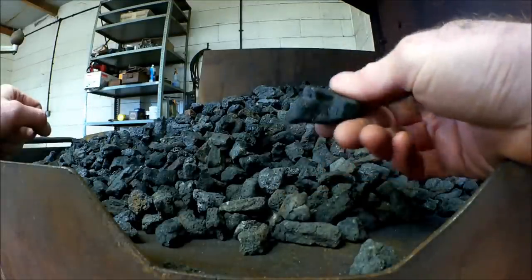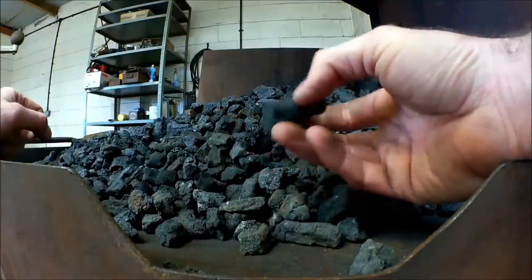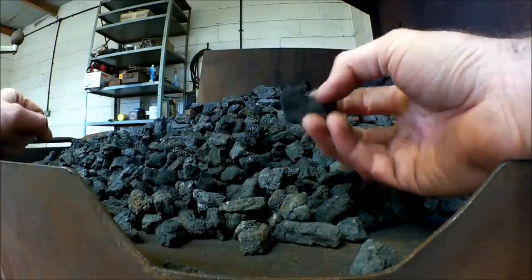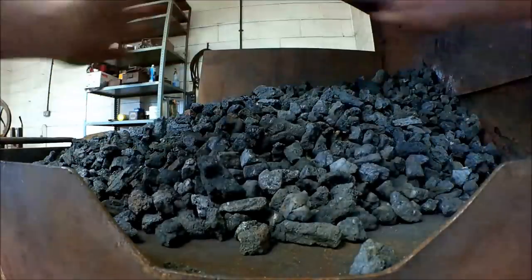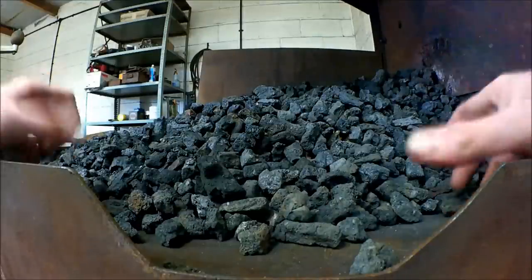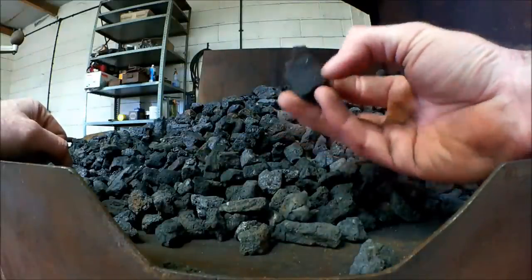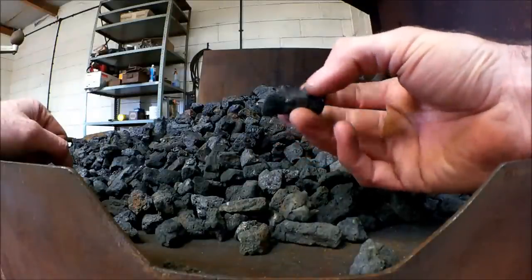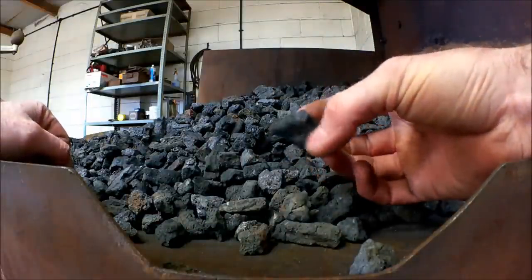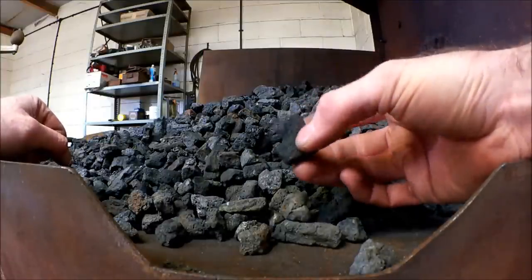Back in Victorian times they used that natural gas to light and heat everybody's home. The reason why you'd want to use coke instead of normal coal is that coal will actually light by itself — the whole thing becomes a blaze. So people worry about putting too much coal on because it's too hot and wastes fuel. The difference is coke needs a huge amount of oxygen to stay alight, which is why you need a fan running all the time. It's very difficult with bellows unless you've got someone constantly feeding that oxygen in.